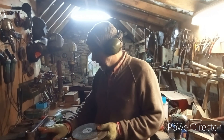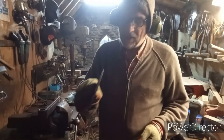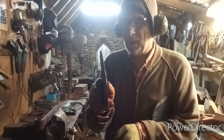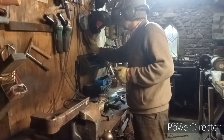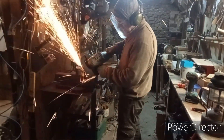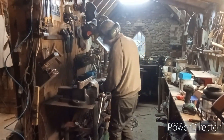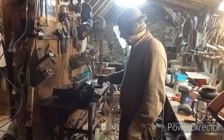So what I'm going to do is grind an edge on this. I've just done a chalk line to where I want the taper. I've changed the blade in the disc cutter — you can see that's the one I had in there before, it's about three mil thick. This one is about six, seven, eight mil thick depending on which one you get. So I've put a much heavier grinding wheel in there. You've got grinding and cutting, so at the moment this is going to be just a grinding disc. I'm going to just persist with that until I can get the edge that I need.